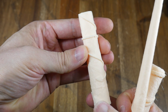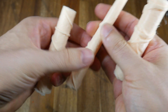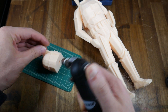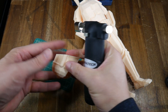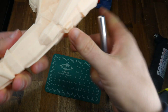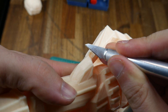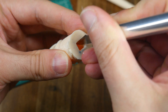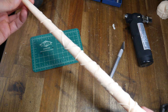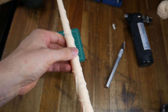Hermione's Wand may not have the stair-stepping because there are no shallow surfaces, but there are some obvious loops on the underside of the decorative pattern, and it comes in three pieces, so I'll need to join them and fill in the seam. To get rid of the stringing, I used a torch to quickly melt away the fine strands of filament. I also used a blade to scrape off remaining bits, address a tiny bit of elephant's foot, and remove some obvious separated plastic loops. Once the wand pieces were able to fit, I super-glued them and the pins in place permanently. The seam between the different parts is quite obvious and should prove to be a good test.